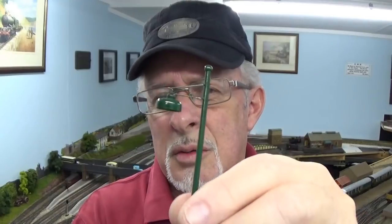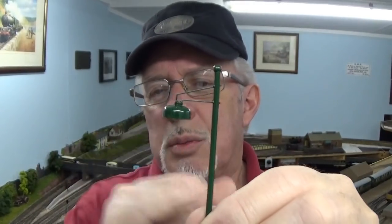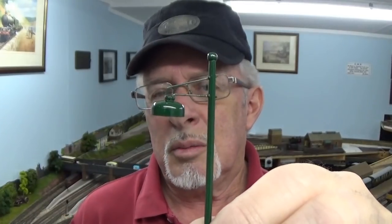The light cover here is what they call a screw cap — a plastic screw cap. There's an inner part which fits onto the screw head, and then this cap goes over the actual screw head. The size of this one for HO scale is probably a little on the big side — it works out to about three scale feet across. But the inner part, which I'm using for the second build, the working light, is considerably smaller, around about two foot six. So that'll be more realistic.